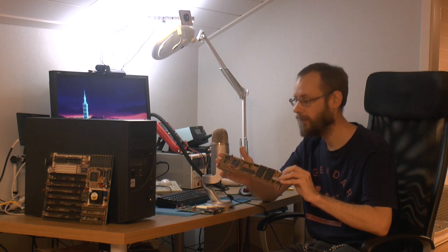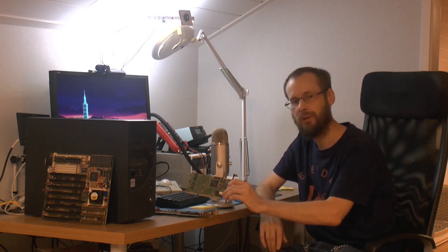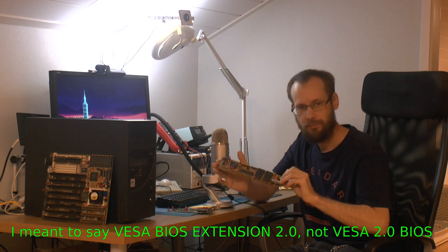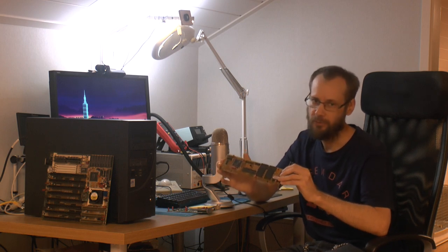I use 5.3A. And if you load that, you can select the 320 by 200 mode, which requires VESA 2.0. You can select the highest 640 by 480 with like 1.2, maybe lower. I haven't tested. I know this card should have 1.2 on it, the Cirrus Logic 5428. So the test is basically the same, just that I was wrong about what mode I was running in when I didn't run VESA 2.0. The point is that if you load a VESA 2.0 BIOS, you can use the VESA 2.0 320 by 200 resolution, and that is faster than the screen buffer mode in Duke Nukem 3D.